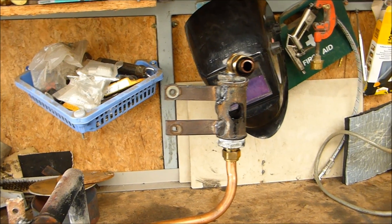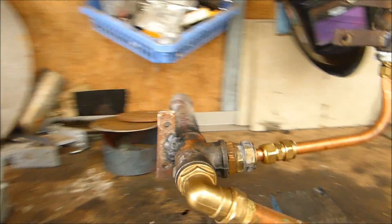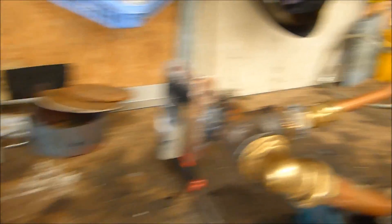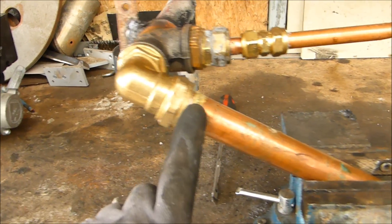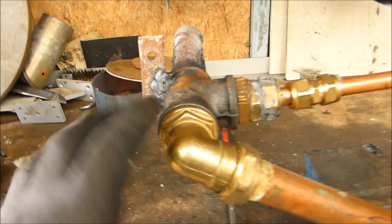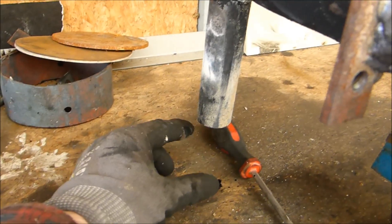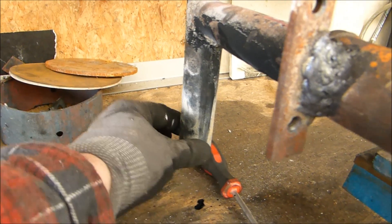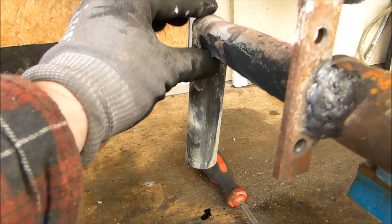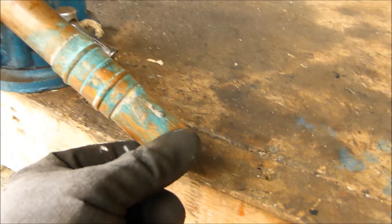This is the burner unit as seen from the back of the stove. This one-inch copper pipe is the air intake — it just blows air straight through and down this one-inch gun barrel tube, which is one-inch mild steel pipe. It goes up, across, and here — down along here — and at the end I just blow air in.